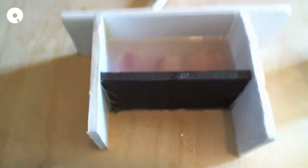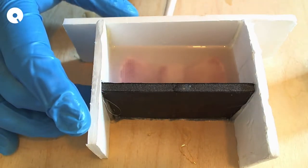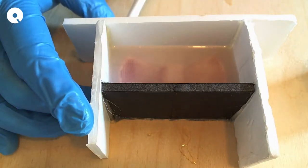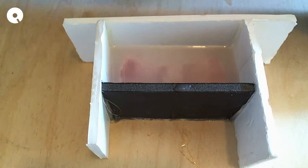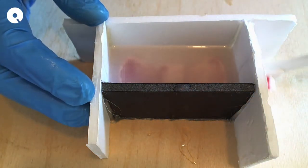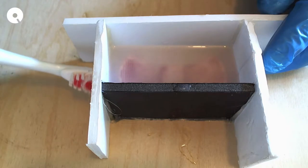The whole thing about making sure that the clay was tight against the box is, man, this stuff is insidious in how it can leach out, wasting time that you really didn't think you had. So it's super important to have a good tight seal. That's why the hot glue on the edges, the hot glue on the seams.